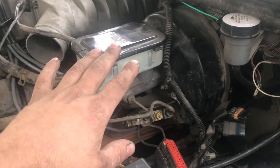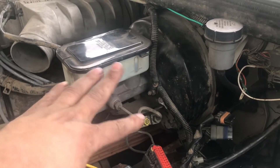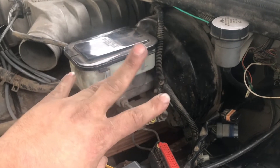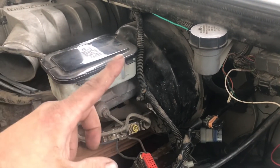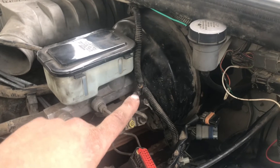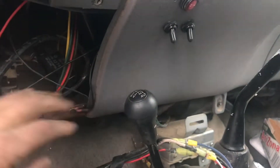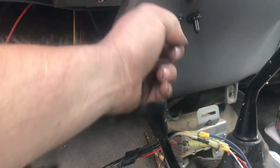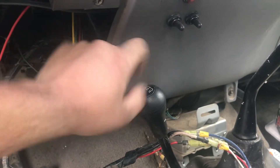Keep in mind, I'm never gonna be running all four blowers at once. The reverse blower will only ever be on by itself. The vacuum blowers and the pusher blower — that's three blowers — will all be running at once. At three amps a piece, that comes up with a nine-amp total. 15-amp fuse, we're 30% stronger in the fuse, so we should be good there. 14-gauge wiring all the way to the back; the switches are rated for 20 amps a piece, so we're all good to go. The power wire comes in — I have this switch jumpered to this one, so one power wire, this red guy right here, running to both of these, powering both off that 15-amp. So we can turn both of these on, but it does nothing because all that did was connect the power through these switches, sending it to the back of the truck.